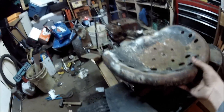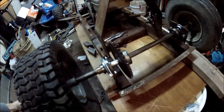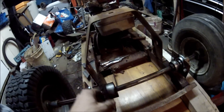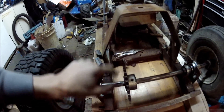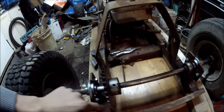That pulley is going to run to a jack shaft, so just get everything sitting on here. Back to this sprocket — what I'm hoping I can do is push the belt up, flip the sprocket around, or whatever. I only have keyway until here, so I'm going to try to get it that way so I don't have to cut a new keyway into it. We'll see how that works out.